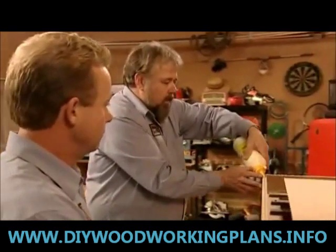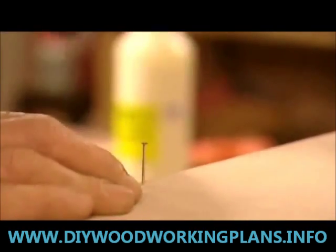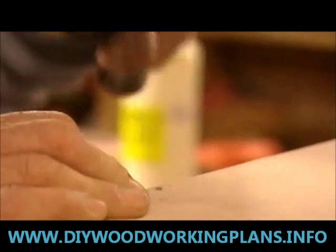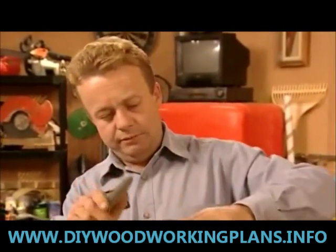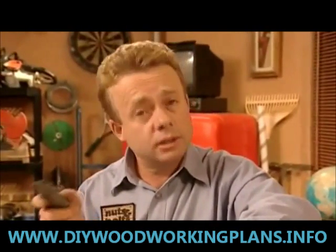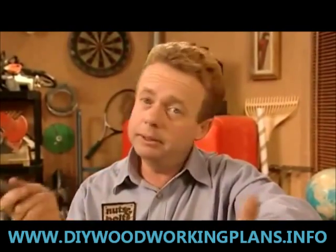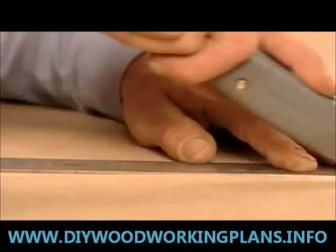Then glue and, using 25mm flathead panel pins, attach the 3mm MDF sheet to the back of the wine rack. We then score with a trimming knife and carefully snap off the excess MDF sheet. So all we've got to do is trim this both sides, snap it off carefully, nail the top, and that's it. Is that right? Hopefully. Okay. Careful.